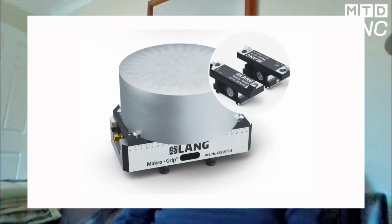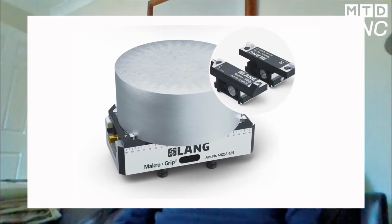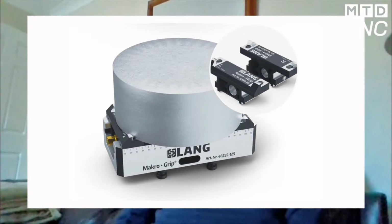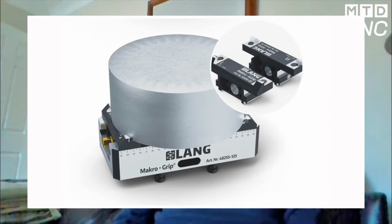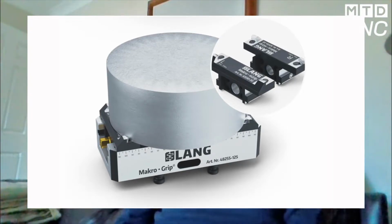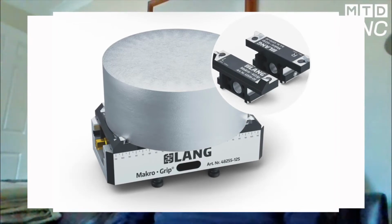So is it as easy as stamping square material? You literally put it in and it stamps and you put it in your vise? Yeah, so there's a new set of stamping jaws for the rep, which will fit any existing stamping unit with the customers, and then there's vice jaws, which again will fit all of the standard vices that customers already have. So by changing 4 cap screws on the stamping unit and changing over their vice jaws, which customers often do just to reverse them to get the bigger clamping range, you're up and running.